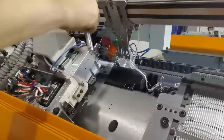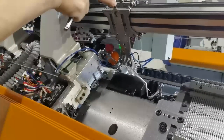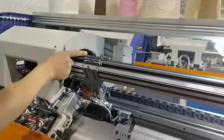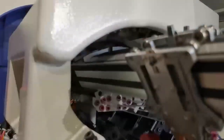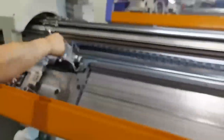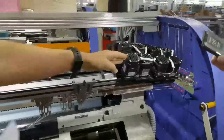The up-down yarn feeder — you can see we put it here and the yarn feeder moves up and down. It's controlled by the chariot cam, and the left and right movement of the yarn feeder is driven by a belt, which is driven by the motor here.